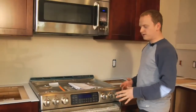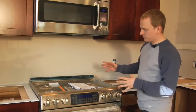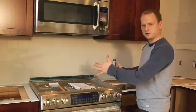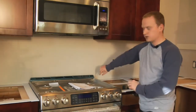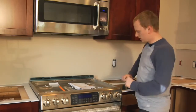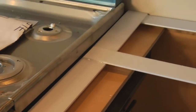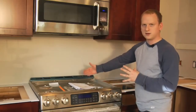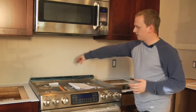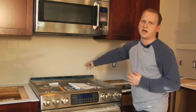It is very important to have the appliances on the job site, especially the stove. We need to make sure it slides in perfectly into the cabinet, and we actually align the templates so that once the countertops are put in, the gap is not excessive — just enough to service the stove in case you need to pull it out. Also, different models of different brands require a different distance from the wall, so sometimes a filler strip of granite is needed in the back.